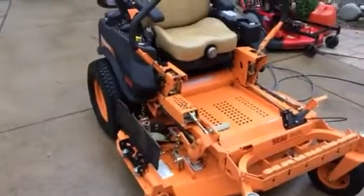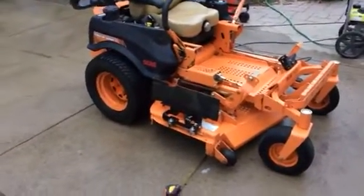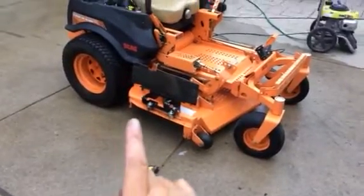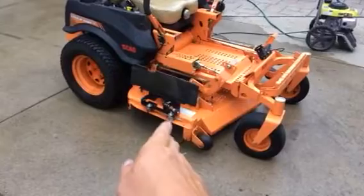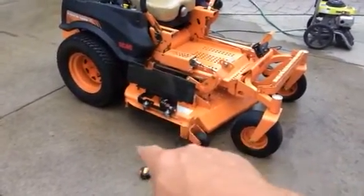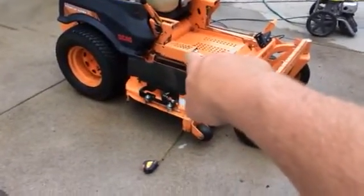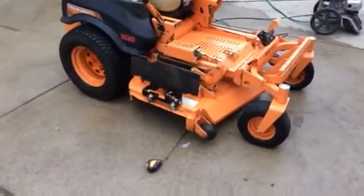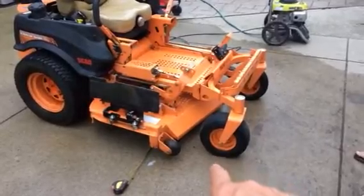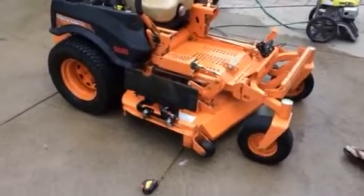I took the time to kind of measure the blades and the blade tips. And actually in the manual it doesn't say where the blade should be positioned when you measure, but if I have them pointing straight out from the discharge side, I guess, the measurements are in sync with your little pin guide thing. But we know when the blades are pointing straight forward, that's where they're at their lowest point, since the deck is tilted a little bit down in the front.